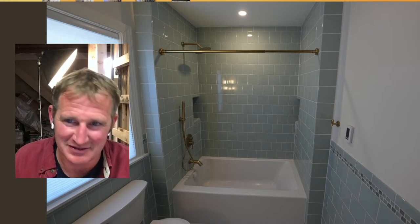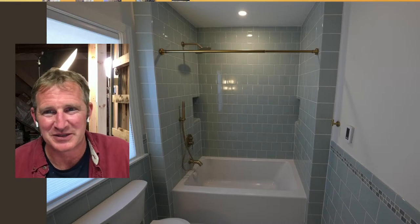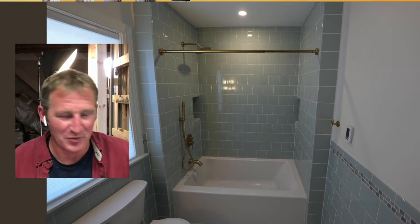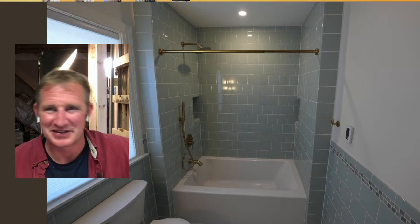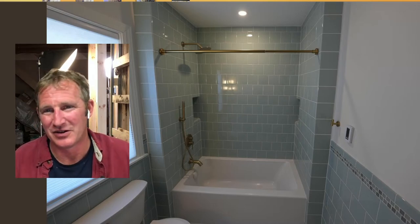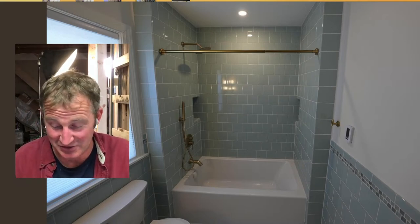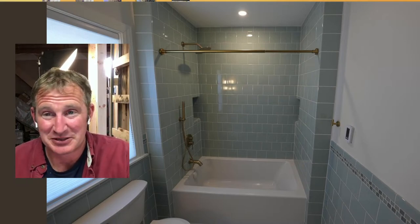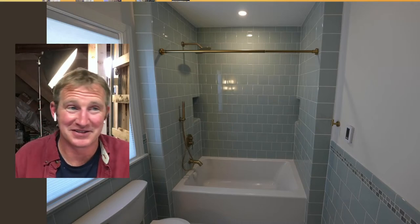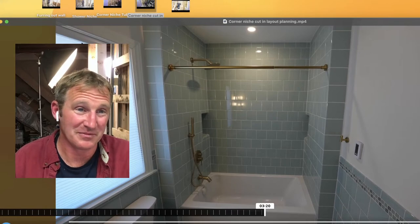So it doesn't really answer your question there, Ruben, but there's just a lot of different systems out there. Some people can't get some of this foam board. We had a lot of shortages out there. So that's kind of why I went with the sheet membranes. And everyone can pretty much get cement board. I don't think they even had a shortage on that. So cement board is always going to have the test of time behind it, most likely. And just doing a liquid waterproofing on it makes a lot of sense.